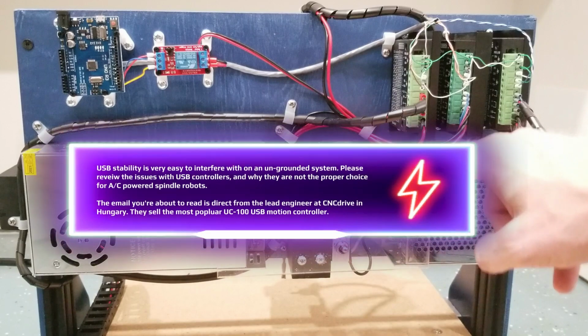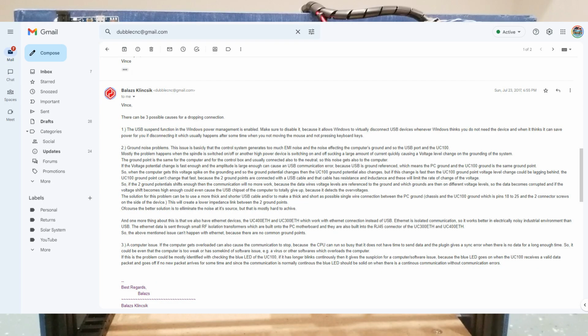If we don't do this, we are subject to those gremlins, so to speak, and then we start having USB disconnect issues. That's the most prominent. You can have usually e-stop issues. They come up secondary to that. USB, what you typically see is a loss of connection, and it can go from in the immediate of doing a cut. You'll notice it in terms of that. You could see a switch being triggered that is not being triggered. I use the term ghosting because that's essentially what it is. And you want to be very careful with who you're learning from.